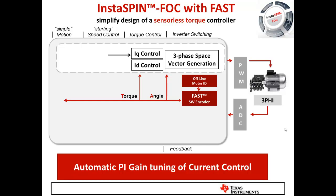We use these parameters to set up a stable field-oriented control system, which maximizes torque production and minimizes current usage by controlling the IQ and ID elements of the current. The IQ and ID PI controllers are automatically tuned from motor parameters, giving you a stable current and torque control system. We can modulate the proper waveform onto the three-phase inverter in pure sine wave, space vector modulated sine wave — which provides additional voltage for higher speeds — or pure trapezoidal waveform, which maximizes bus voltage for maximum speed.